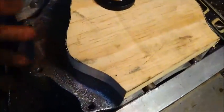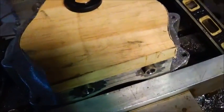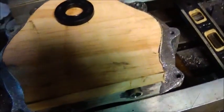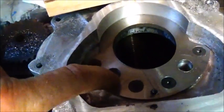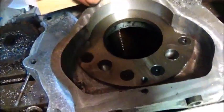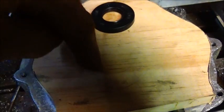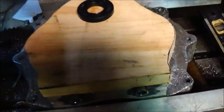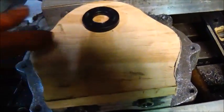This is a little bit big because you've got to remember I'm going to have shrinkage, and I've got to angle everything too. But this is not going to be nearly as bad as the other covers, I hope. I'm going to bring it over on the mill. We'll take it off, and then I'll find our hole, and then I'll raise up. I'll sit our cover back on, and then I'll come down to it, and then I know that's where we need to go around it for the boss. And hopefully when we're all done and we get them drilled, they're all where they need to be in the center and they don't look bad.